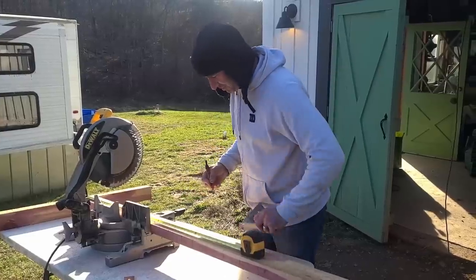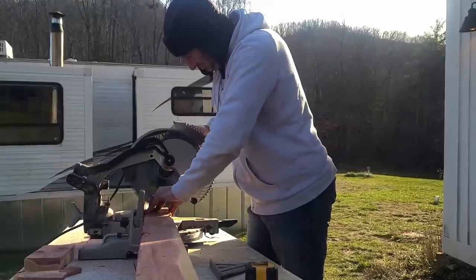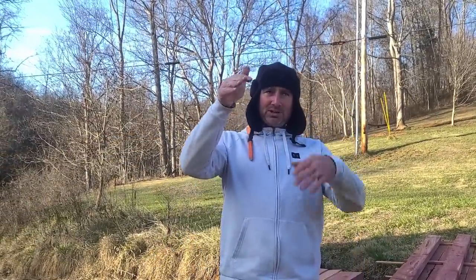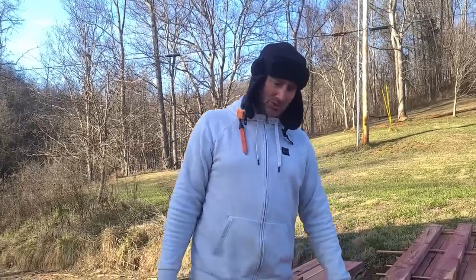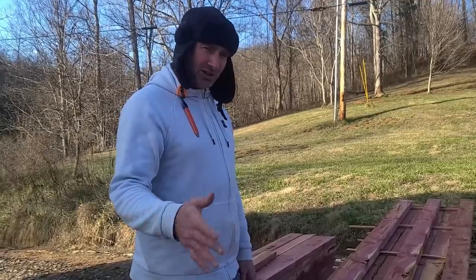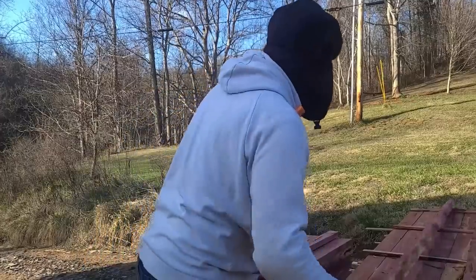You know, let's speed things up here. With the speed square? Noggins. When you're doing board and batten, like our shed here, when you put up your boards, you're going to put it on the top and the bottom. You need something else in between. We only need one noggin, but you need something horizontal to attach those boards and battens to. That's what the noggins are. John tends to call them interesting things, though. Goblets! Goblets.